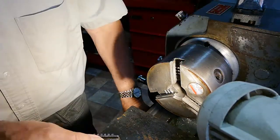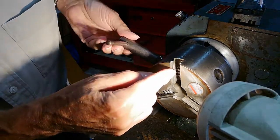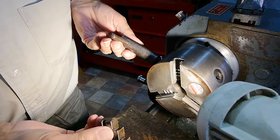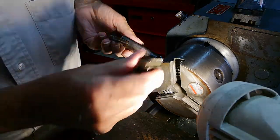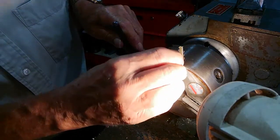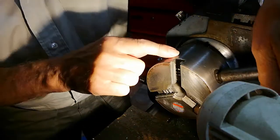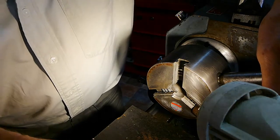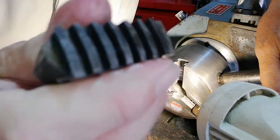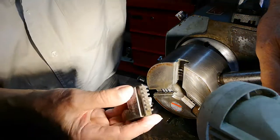First you've got to line up the number one, and you'll see the scroll coming round here. Look, see, that's just past it. There, it's just going around now. So you get your first one, and you put your number one in there. It's a reverse jaws. So just turn it, and there it started. If you move it back there, that is the number two position. So you get the number two one, which is that one with a slightly bigger thing there, as you can see. The lead, actually, it's the lead.